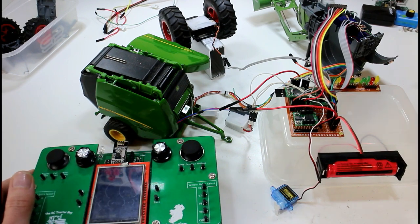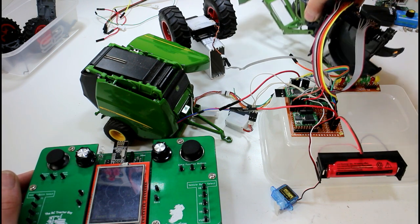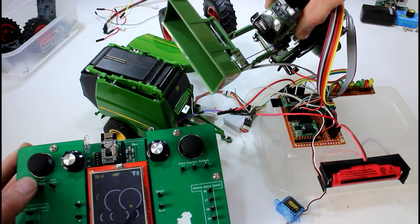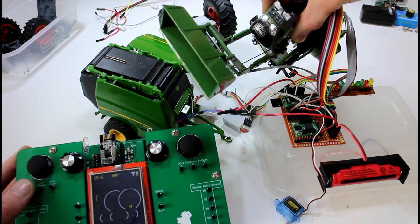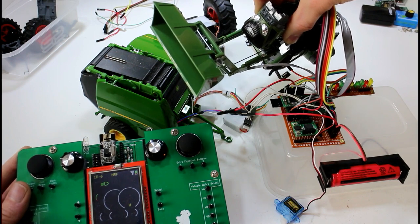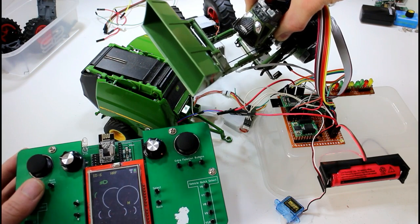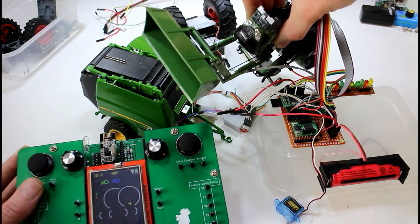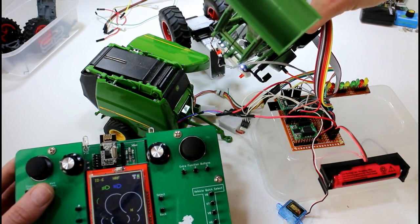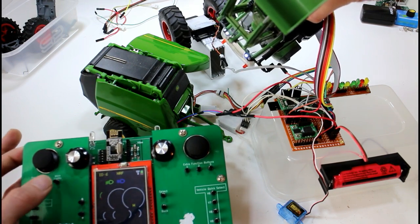You can see our brake lights — or really tail lights — are on. That's because the lights are off. If I turn on the lights, the brake lights will actually go off because it's reversed. Let me try and turn this around without unplugging everything so you can see the headlights. Because the Siku thing is reversed, it's coming on full lights. If I hit it once, we're now pulse width modulating the lights — that's supposed to be our dipped headlights.